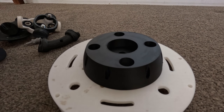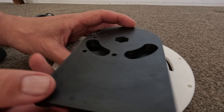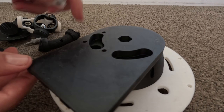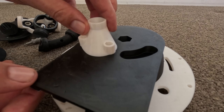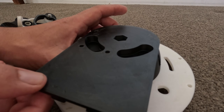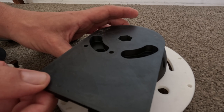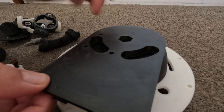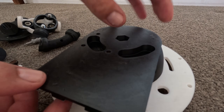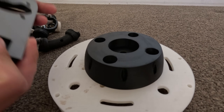That will bolt on there and spin with it. Then this piece here goes inside and will act like a rotary valve — this will be the intake side here. That's just a little thing to hold the carburetor. As it comes around it's drawing in fuel-air, and this side is exhausting. And then around here it's doing nothing because the piston valves are shut. This is never under compression, so it only needs a small — basically a normal lip seal — or something in there.